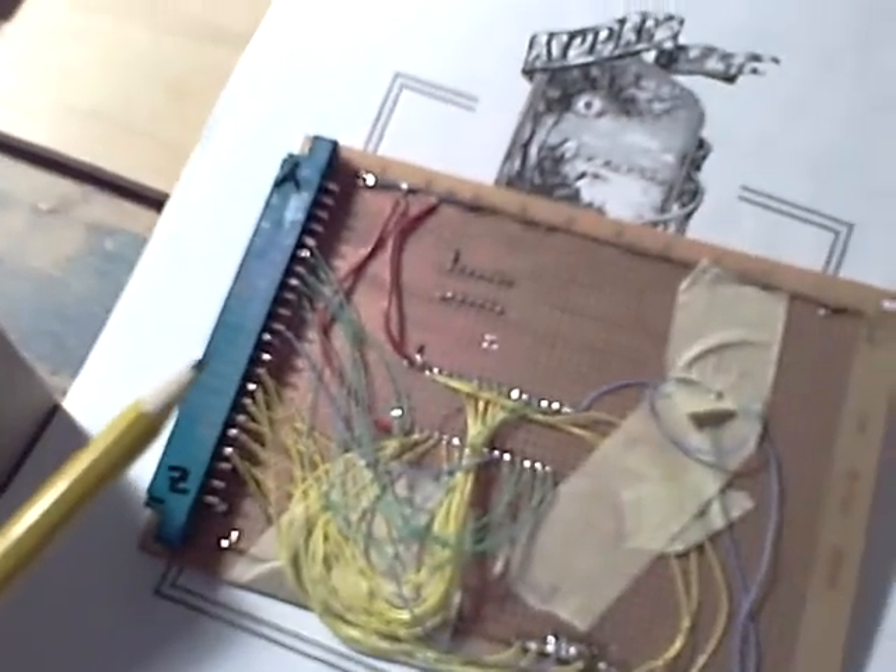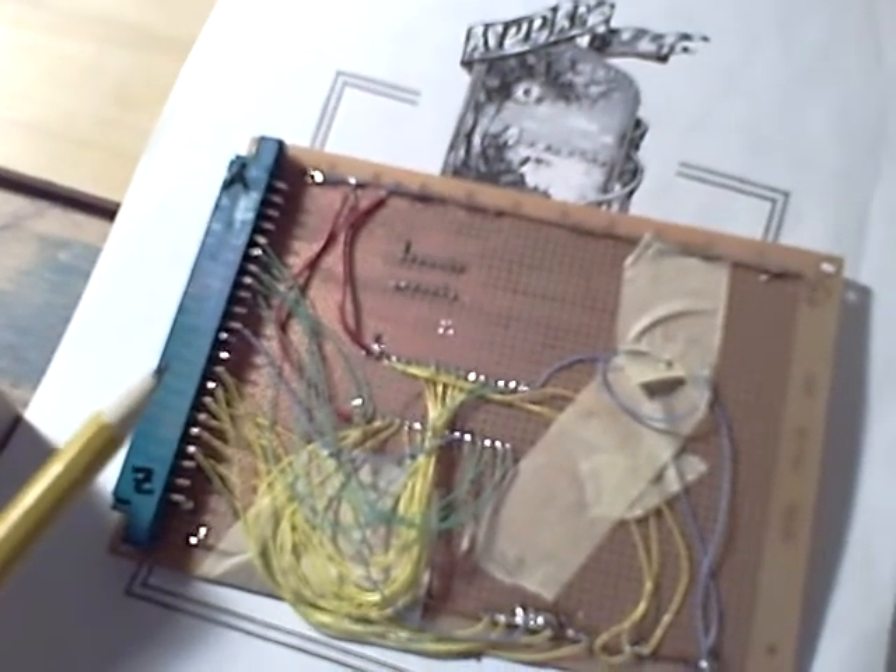Just to show my layout here: on pin 22 on the EEPROM chip, chip enable is active low. The 7404 stuff is gone — don't need that. So basically what I did was I tied output enable to low. I tied all the address lines that I don't need to ground, and the rest of the address lines are tied to the connector, so it will pick up whatever address the CPU wants to see.